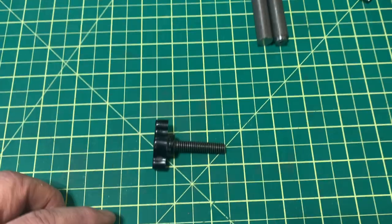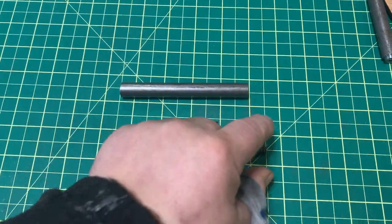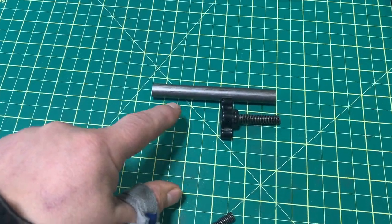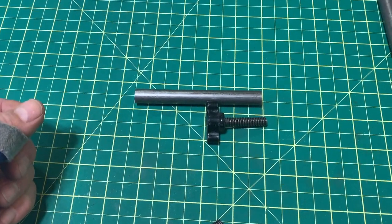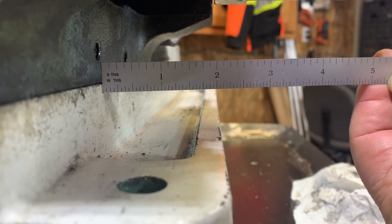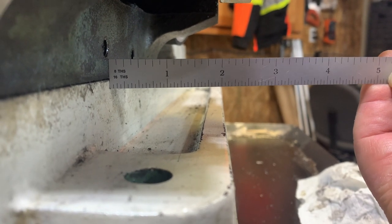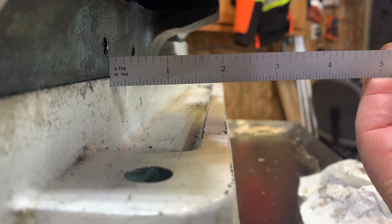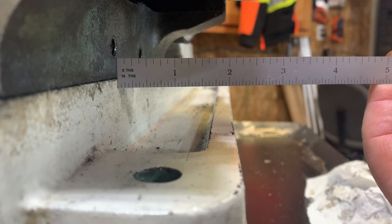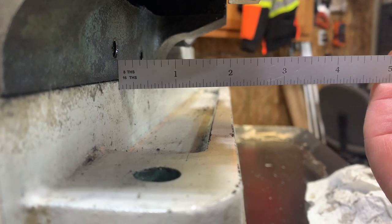Start by making these shafts, which will include our bolt and the shaft that will extend past the frame. We need about two and a quarter inches to clear the frame — that's the minimum length of shaft required. But since we need to set the pivots onto the shafts, we need an extra half inch, so we'll make them two and three-quarters inches.